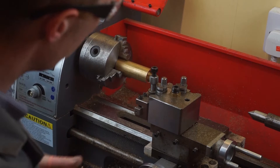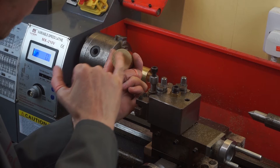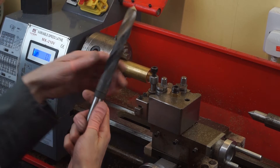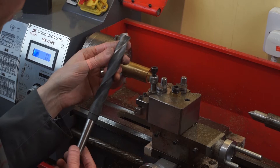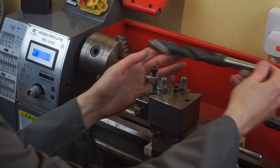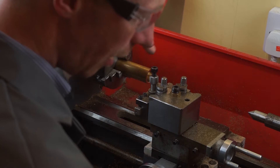So over to the lathe now — I've got some stock already in the chuck. This is 30mm stock and I've already bored the stock out to give us a head start. It starts life as a solid piece of brass, but obviously if we're making a movement ring, a ring has nothing in the middle of it, so we need to remove this material in the middle. I start with a 22mm drill bit. Now I imagine most of you probably wouldn't think you'd use something of that size in watchmaking, but these parts are a relatively large size — the outside diameter of the movement ring is 30mm. So we start with this in the tailstock of the lathe. The one thing about drilling from a tailstock point of view is it's not always 100% accurate, so what I do to start with is get our inside diameter correct, and I do this by using a boring tool.